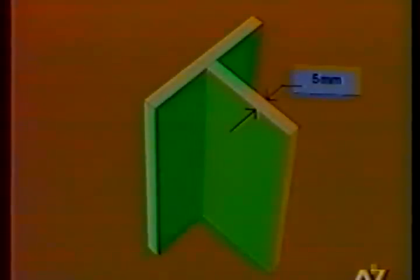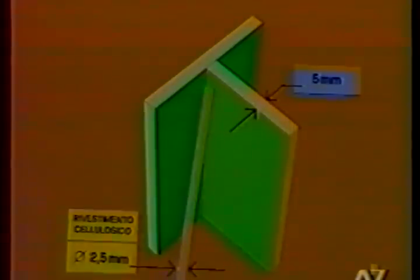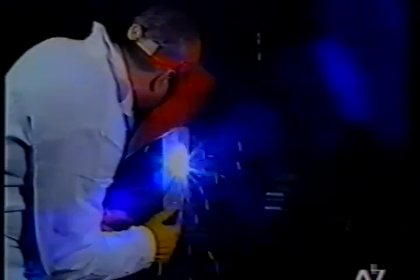It is also possible to perform vertical descending welding for work in position on small thicknesses, using electrodes with fluid and low-volume slag. For this test, a cellulosic-coated electrode of diameter 2.5 mm is used with a welding current of 80 A. The base material is FE 410 sheet metal with a thickness of 5 mm. The welder moves the electrode at constant speed, keeping it inclined at approximately 70 degrees to the vertical in the bisector plane of the angle. The weld pool has no support from below, so the bead is small in size and generally of good appearance.